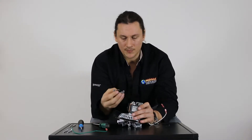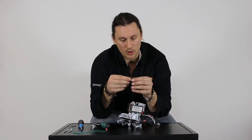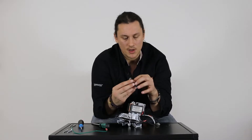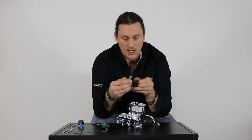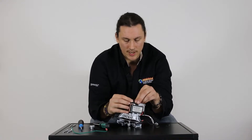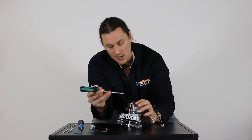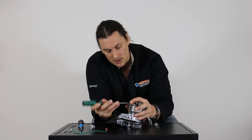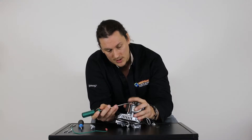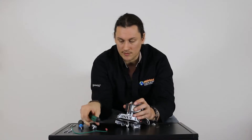And then she'll pop off. Within the cap there is a silicone or rubber protection piece — sometimes that is going to come off with the cap, and sometimes it's going to stay on the bearing. If it is on the bearing, go ahead and get that off. We don't want to rip or tear this silicone sleeve, so just pry up gently on a few sides and make sure that's pulled off. Keep that with the cap.